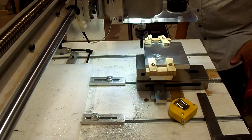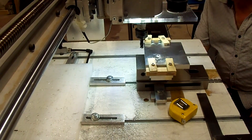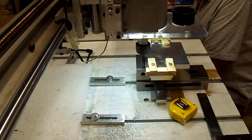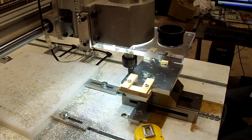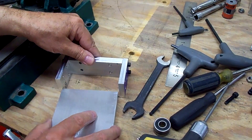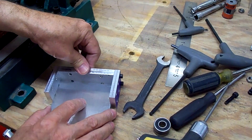I've got it clamped back up on the mini pallet. We've got to take about 74 thousandths off that one side to get it to size. We'll start her up. Actually, that's about a perfect fit.